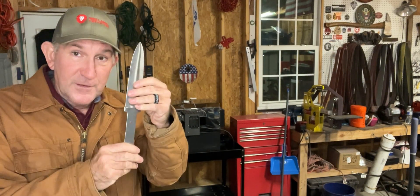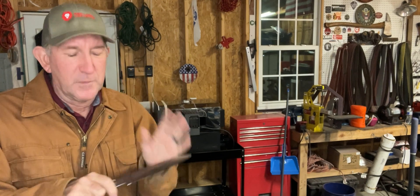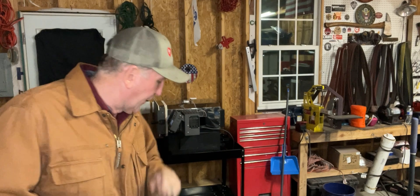It's going to hold at 1575 for 10 minutes — everything I read called it soaking the blade. This steel came annealed, and from what I've read, annealed steel has a bigger grain structure, while normalized steel has smaller, tighter grains. A lot of folks skip normalization when they get annealed steel and go straight to hardening, but I want to play it safe. After soaking for 10 minutes, the alert will signal me to pull the blade and place it in vermiculite for a nice slow, even cool-down. Tomorrow we'll worry about hardening and tempering.